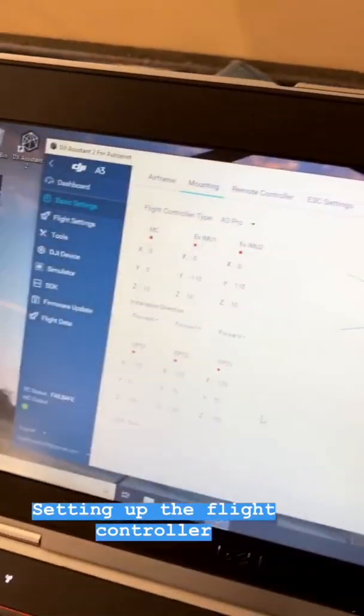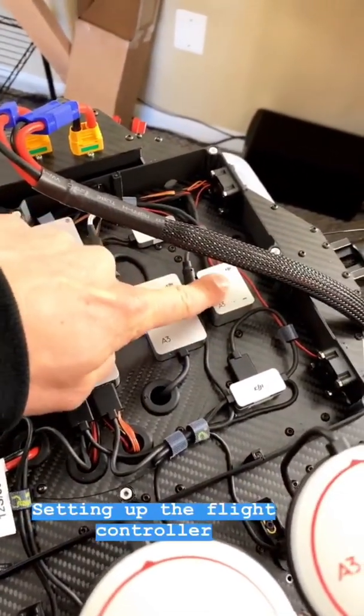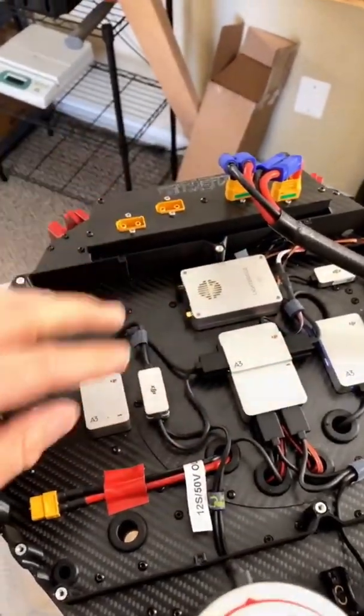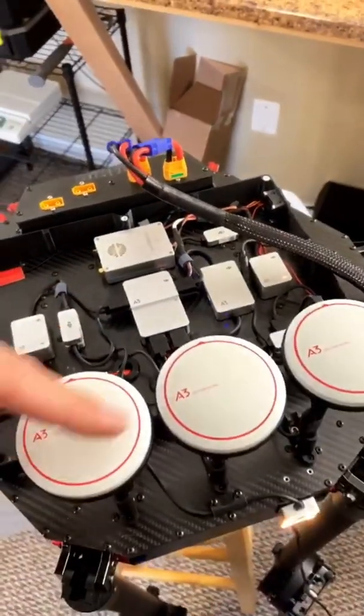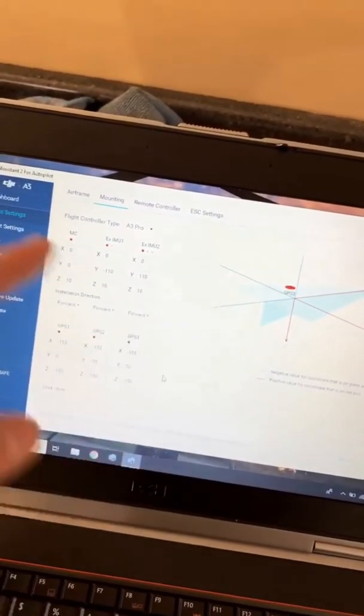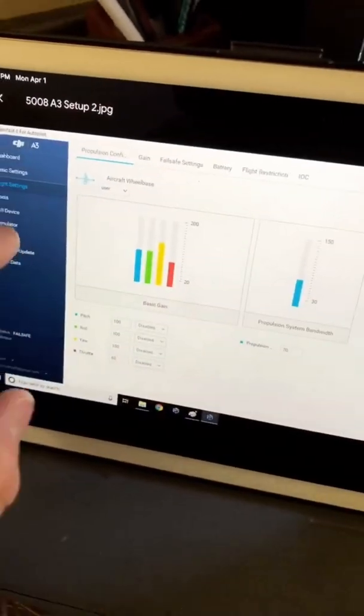Here in this menu, I'm telling the computer where everything is located. I have the central brain, a backup IMU, and a third backup sensor — the third IMU. All three together are measuring the attitude and angle of the aircraft while it's in flight. We've got three for redundancy, as well as three GPS pucks. We really only need one, but we have two more for redundancy. I tell the computer where everything is located. I've got my little setup here with my settings for the MFD 5000 series, since I've done a few of these. First flight is always the hands-off hover, and hopefully we're going to do that again today.